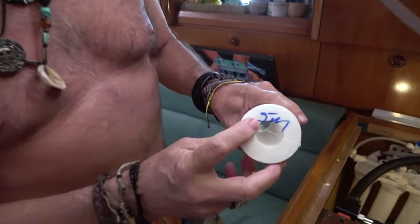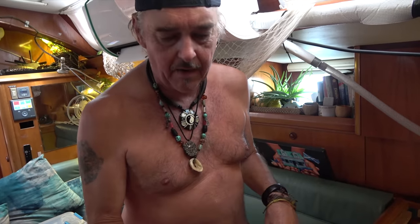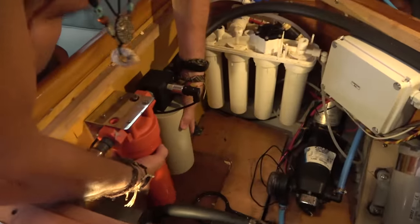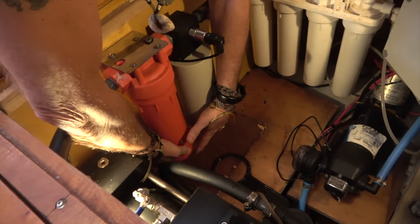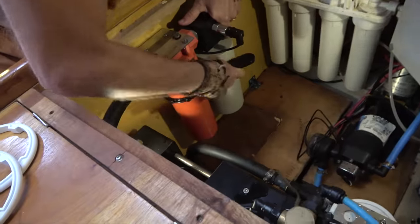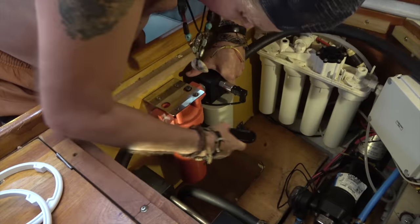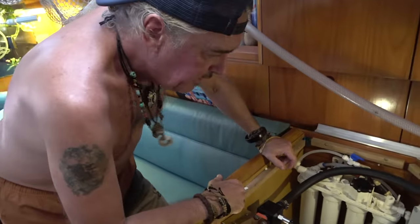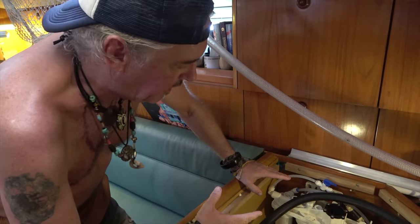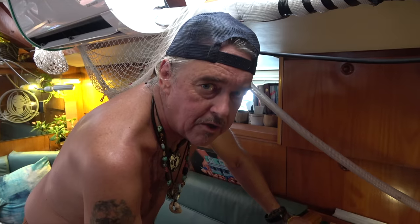This is a five-micron pre-filter — a sediment pre-filter cartridge designed to take out any small particulate suspended in the ocean water, protecting the membrane by filtering all of that out first. We put it back in, line it up, raise it slowly, and screw it back together. You've got to make sure this one is good and tight because it runs at 200 psi — if it's not tight it will gush water. Now, first thing we want to do with the RO system is drain all the water out of the tank, because when we change the filters we'll be running sediment through the carbon filters into the storage tank, and we want to flush out the first couple of tanks.